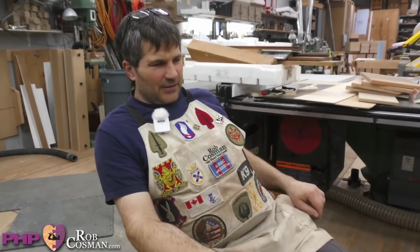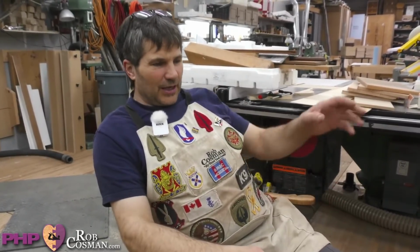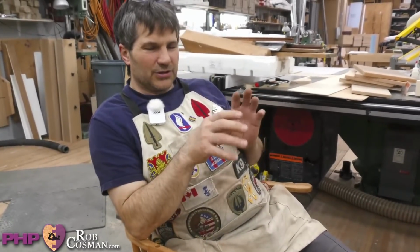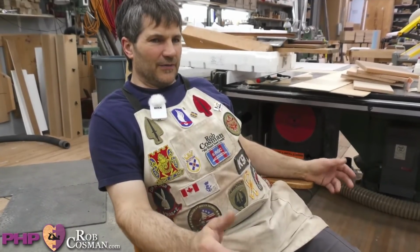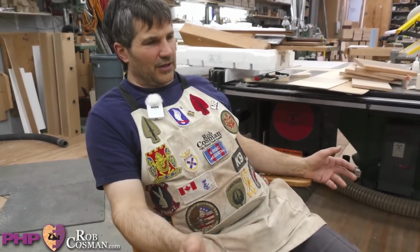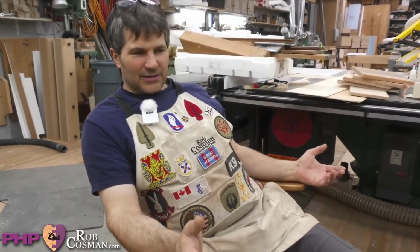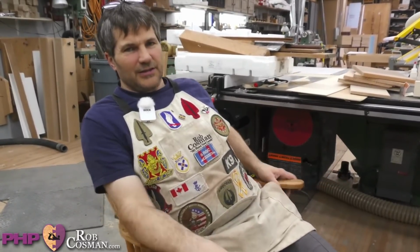No, because not my thing, not my style. It's done on a bandsaw, typically. You cut part of it, and you keep the part that you cut off to hold it to cut the other part, which just reduces the amount of shaping that you have to do. But it's a lot of spokeshave, a lot of drawknife, a lot of rasp, a lot of work. It's just not my style. I've never had any interest in doing that, so I'm sorry I can't tell you anything more than that.